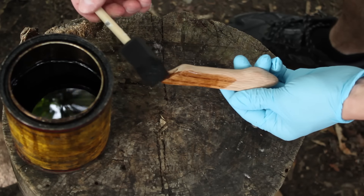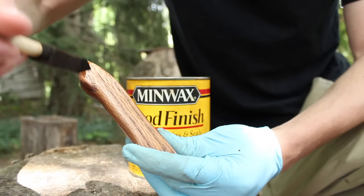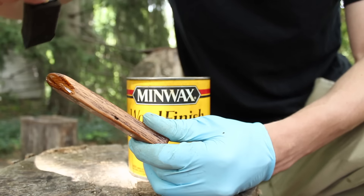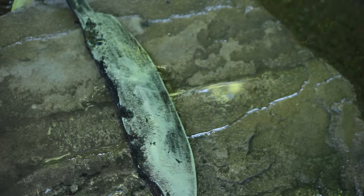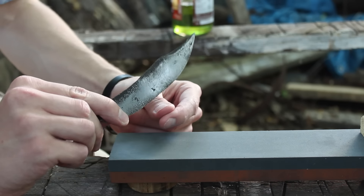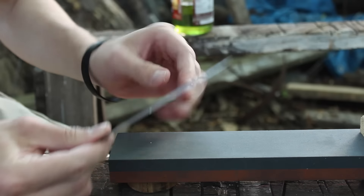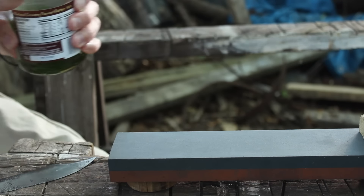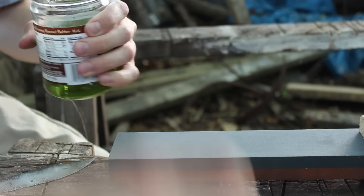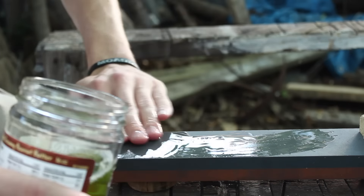To stain the handle I used four coats of Minwax Provincial to darken the color, and then I added a final coat of Golden Oak Stain and Seal to give it a brighter luster. To clean up the blade prior to sharpening I used my trusty sandstone rocks. I'm going to start the process of sharpening the coil spring knife, and right now everything I've done thus far on this has all been done with a file. I've got a Norton Medium Fine Stone — this is the medium side here — and a solution of watered-down Simple Green that I'm going to use to lubricate it.